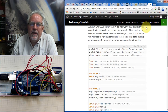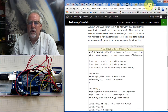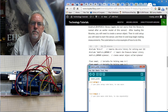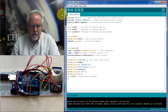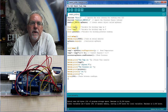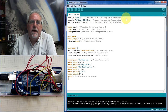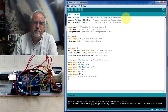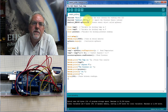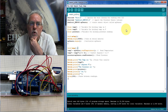I'm going to go to lesson number nine and get that software to start with. Here is the software using Python with Arduino lesson number nine — I'll copy that code and paste it into a brand new Arduino environment. One note: on the Adafruit pressure sensor, we are using their API library version one. They've come out with a version two, but I like version one better. So make sure you know which one I'm using — version one — when you go out and load the library from Adafruit.